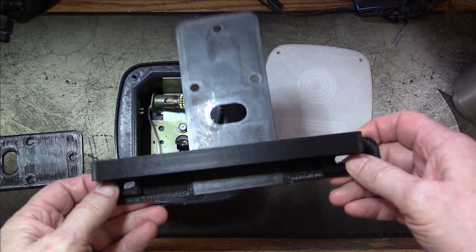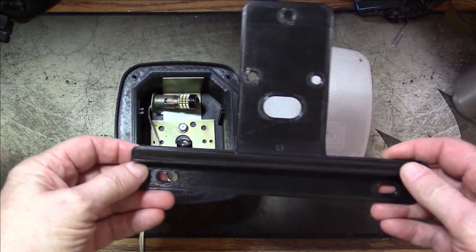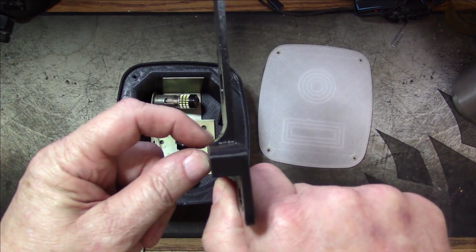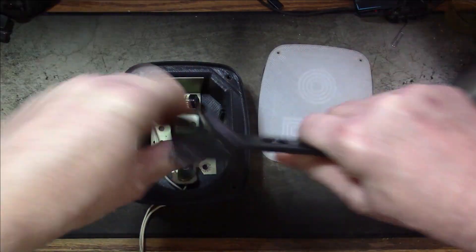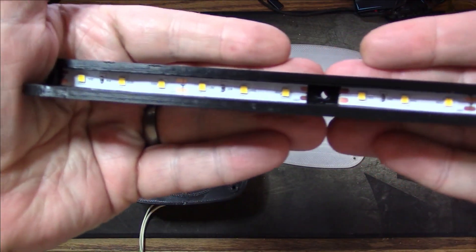But why don't I just make it all one piece? So I jumped back into Fusion 360 and made this. This is, once again, black ABS. It's four millimeters thick. I put a big nice fillet there to give it some strength, and it's pretty darn tough. There's my LED strip tape in there.